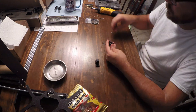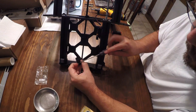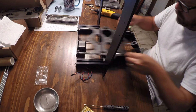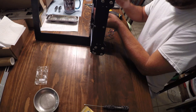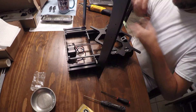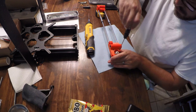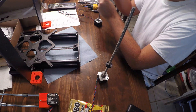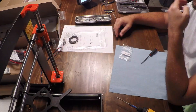When you go through those comments you'll find some users have very good tips and also some minor corrections. One example of this in my case was for the linear bearings. The instructions say to just assemble them as is and use the grease that's supplied for maintenance later on. What I found in the comments was that you should indeed clean them with IPA and do a sufficient greasing.